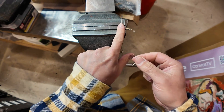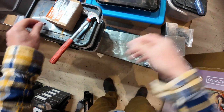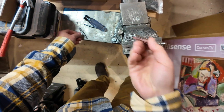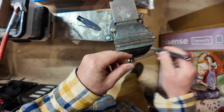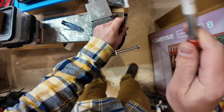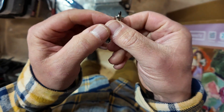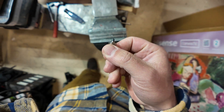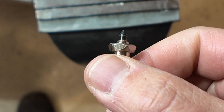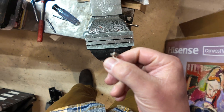I've got a 1.8 millimeter rod here. I'm going to slide this on and then use this screwdriver as my hollow shaft to stick over the top, and then hopefully pound that out. Okay, that actually started to work — look at that. So that slipped right out of there, just a little bit of force.